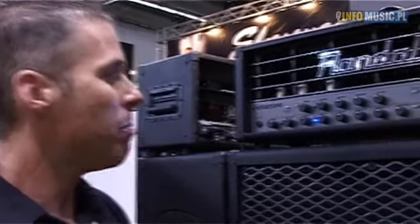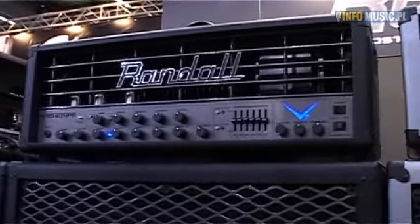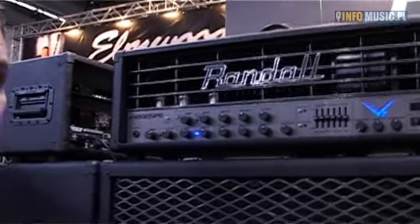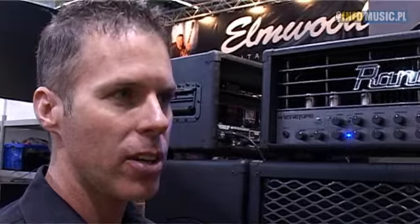It depends on how hot it gets. The fan will be variable speed. But the amplifier has so much power. Very high gain. Has a real tube sound, but very reliable because you don't have the big power amp tubes. The big power amp tubes are what generally fail on an amp. Like the ones out there have big power tubes. These just have the small preamp tubes.